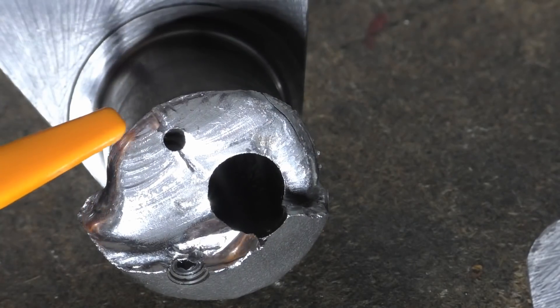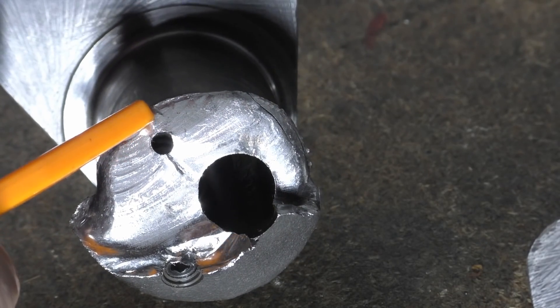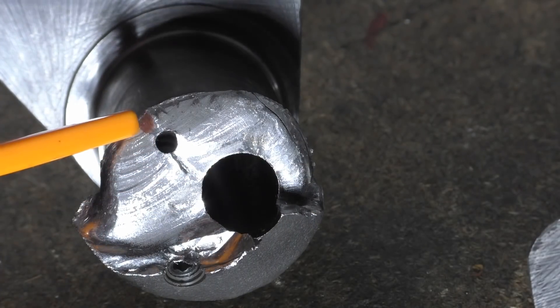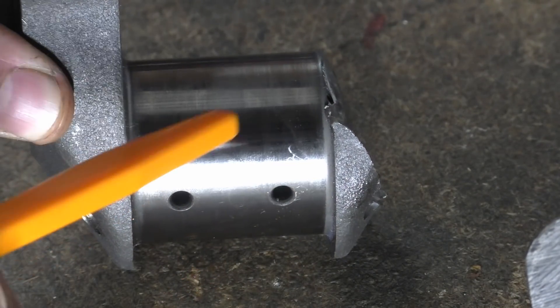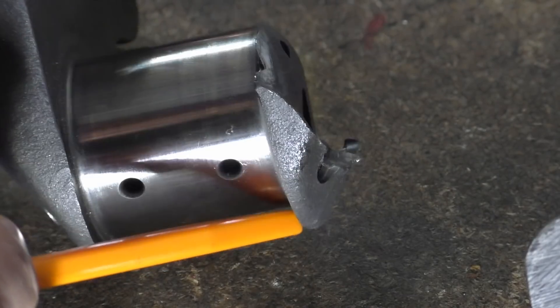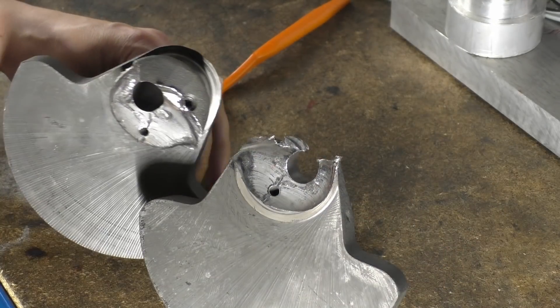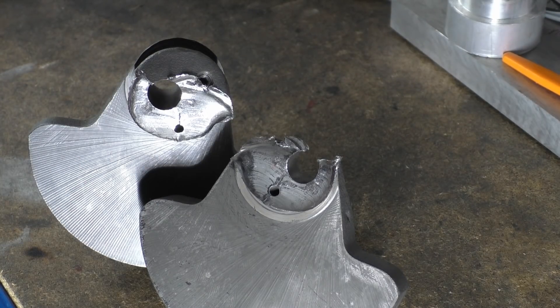There's actually a shiny bit there — I can't tell without a microscope, but it's probably been polished as these two parts clapped together and hammered it flat. It's a failure right at the fillet — you can't see anything wrong with it, it's literally right on the fillet. Even with that fillet it hasn't helped. A bigger fillet could help — I'll do a simulation to show how much difference it would make. Generally, a way to get around this would be to make your crank pin thicker. This is a one-off failure that happens now and then — not all the time — but it is quite common.